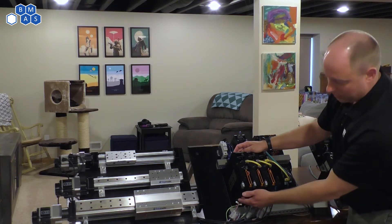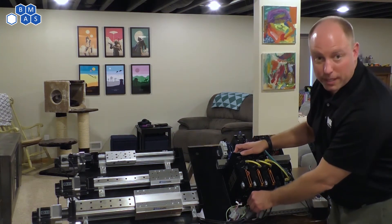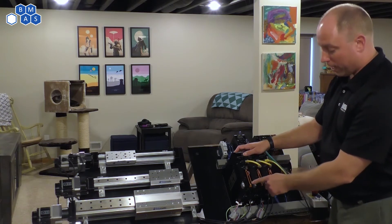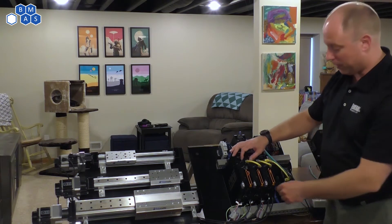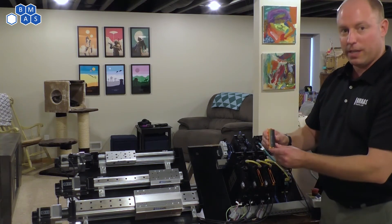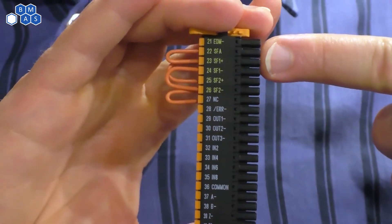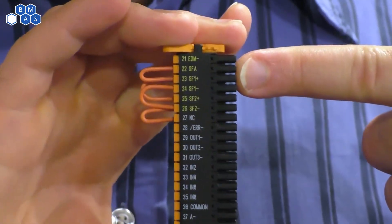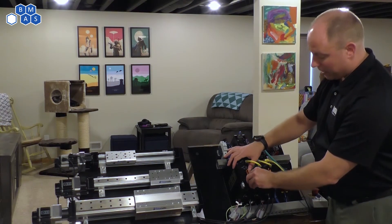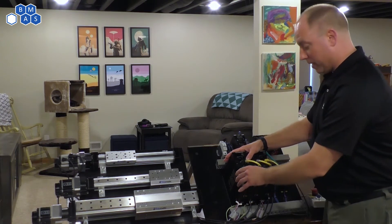The power to the motors that we see over here comes out of the bottom, as well as the encoder connection and obviously the grounding. And then what you're gonna have for your I/O power is right on the face of the unit. What makes this kind of handy is that these I/O modules can be removed, and on the physical I/O module it has a wiring diagram — it actually tells you exactly what each of these terminals is for on both sides, so you know exactly how you're wiring it. When it's time to plug it back in, simply snap it back in.